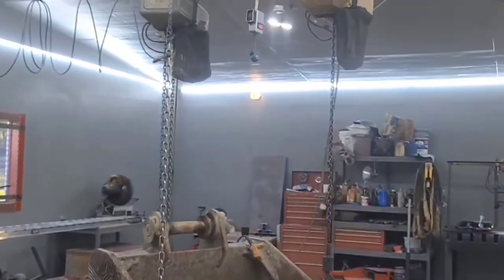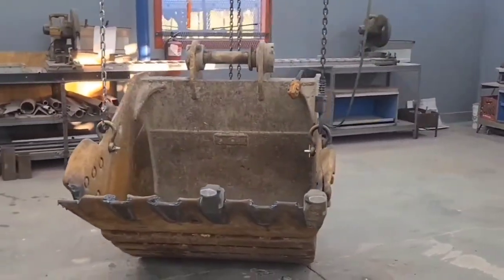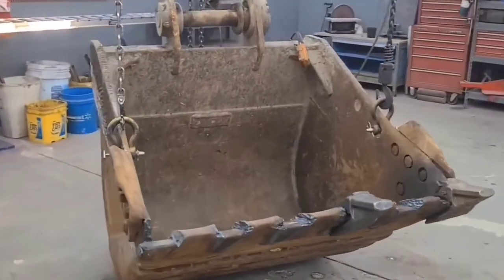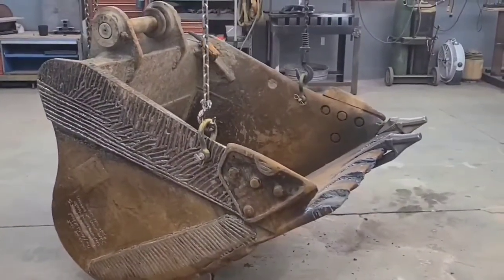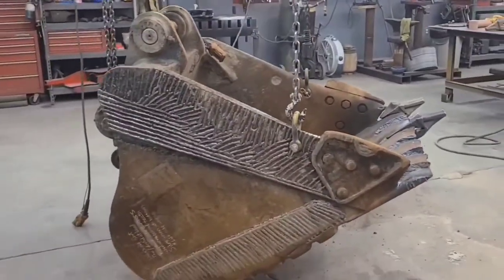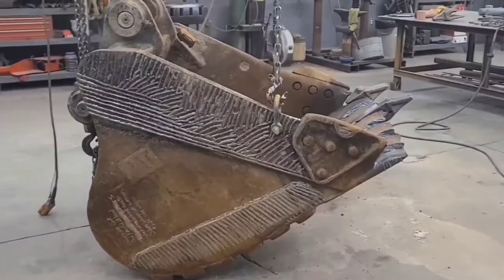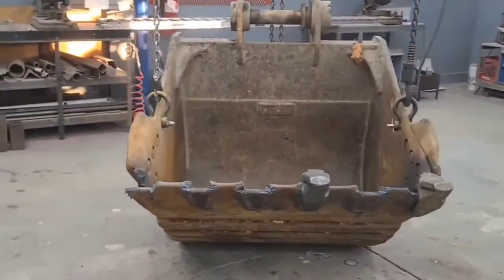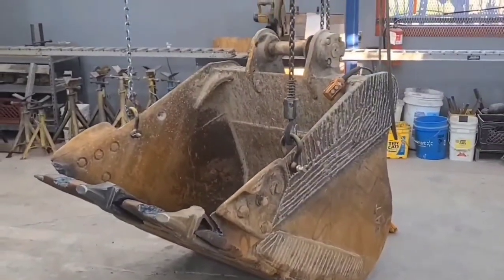And this is an example of just how good and handy the hoist system is in here, to have multiple hoists. I always said, for metal fabrication and welding, don't give me one 10-ton hoist. Give me 5 2-ton hoists, because you want to flip things over, you want to roll things around, you want to get things in position, and this is the most efficient way to deal with this kind of stuff. All right, let's get to it.